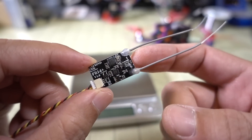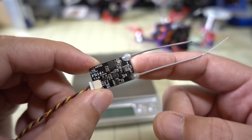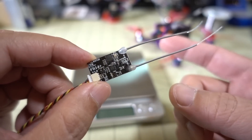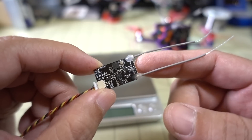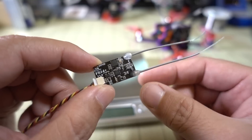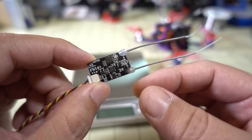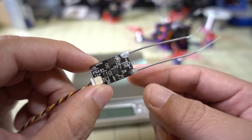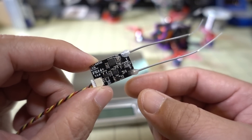I'll show you my flight demo at the park with the OSD overlay showing the RSSI and how far I can go. I didn't get very far on 100 milliwatts of video — my video range was actually much worse than my control range. I'll probably have to do another test in the future with something that has 600 milliwatts or more, better antennas, and a different location. I may even test on something with GPS so I can use return-to-home in case of failsafe and determine the maximum distance.